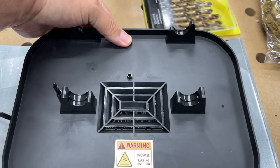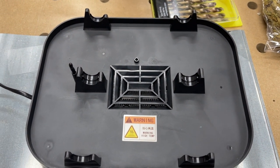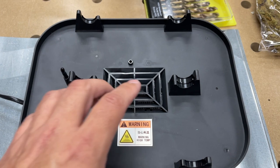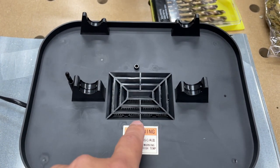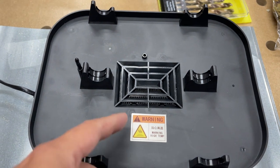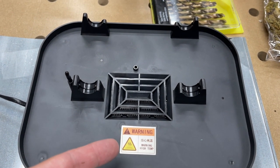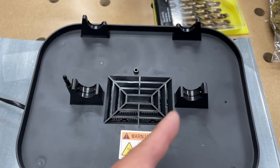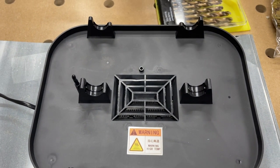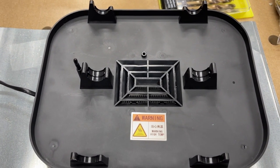More importantly, as you've seen in a previous video — I'll link that in the description and at the end of the video — this has a flaw. I think it produces really good airflow and heat, but this part and this part blow right exactly where the filament is. Because the heat blows directly onto the filament, it heats up a single spot. Even when you're printing and spooling the filament, it can get pretty hot in that spot. Especially PETG seems to be an issue — anytime we're getting more than 50 degrees Celsius, it gives me problems.